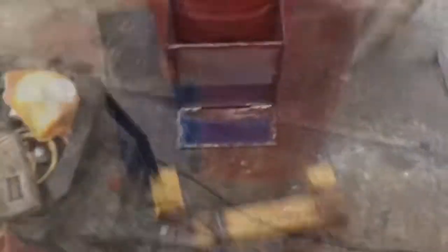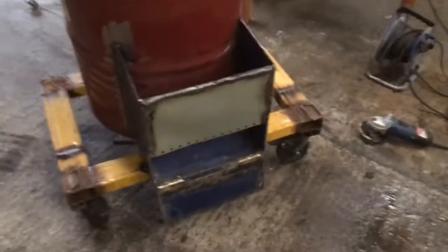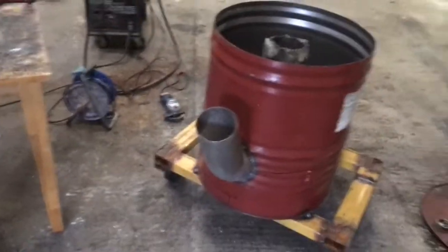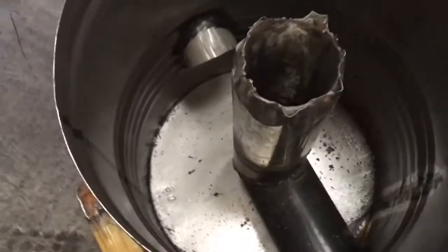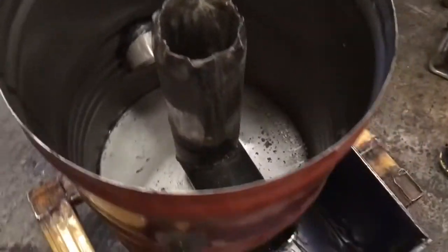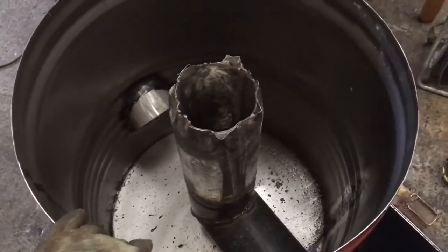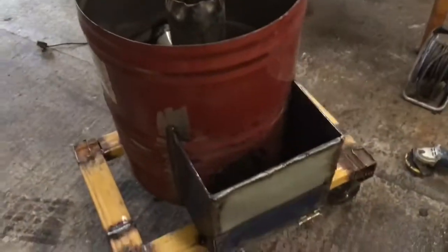Fire box all done last night, with a door so I can clean the thing out. Trolley with wheels all made. Fire door there for cleaning out the fire entrance. Tucked in place so I can move the thing about if needed until it finds a permanent home. Starting to look like something. Just got to cap the top of it, drop some sand in to insulate the bottom, and better clean some of that diesel over there or that could end up in disaster. Bit of sand insulating up to the exhaust over the bottom of the intake. Cap it, put the chimney on, add brackets and a catch to keep that up. This thing's almost ready to fire up.